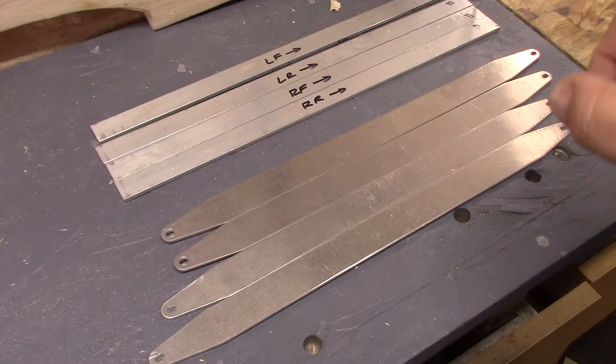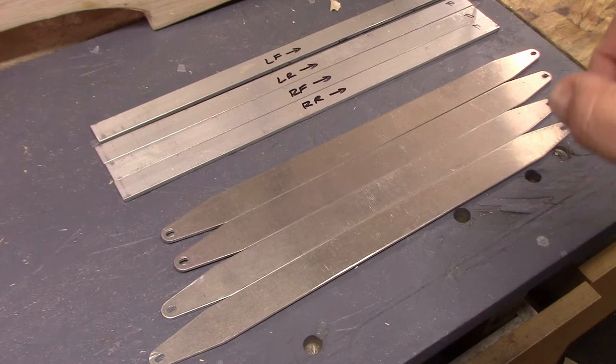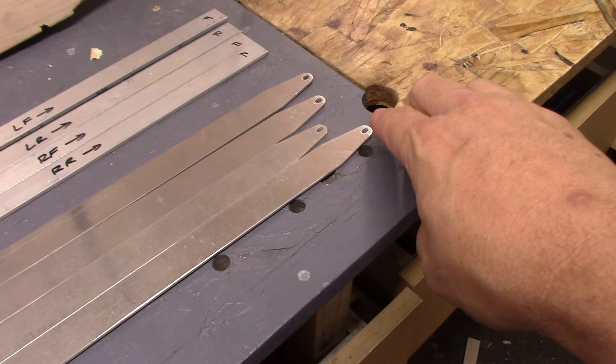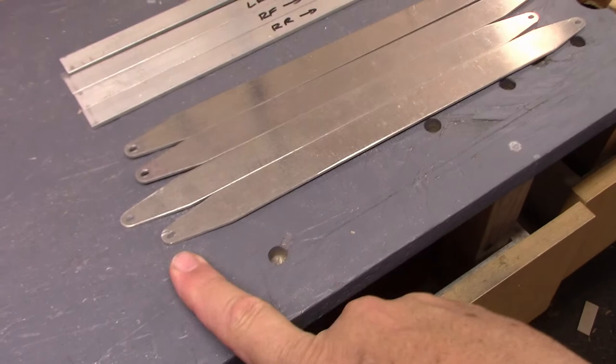The other changes I wanted to make — the interplane struts — I wasn't too happy with them. They were far too flexible, and I was going to have to make changes just for distance. I didn't like the ability for them to slide up and down. I wanted rock solid points, just one hole on the top and one hole on the bottom. So we're going to be doing this — this will be the next step and will be covered later in this video.